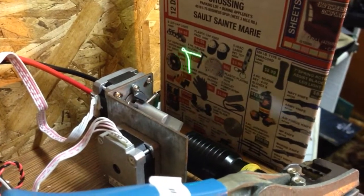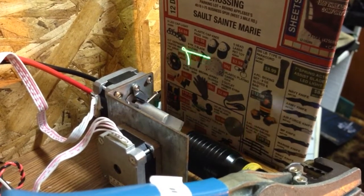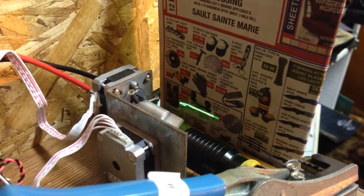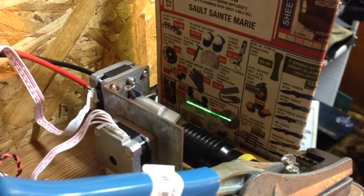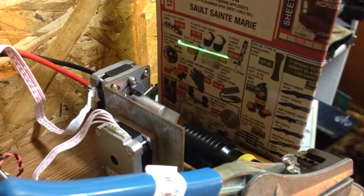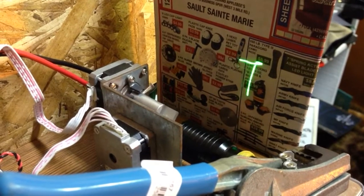Right as it gets to the upper left corner, the bottom right corner fades out ever so slightly. This is unfortunately as fast as I can make these steppers go — any shorter pulse length and they start missing steps. It's at a 3 millisecond pulse time right now.